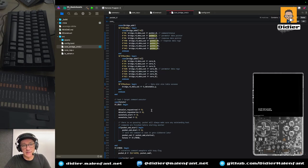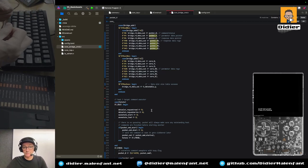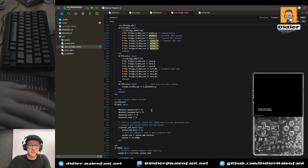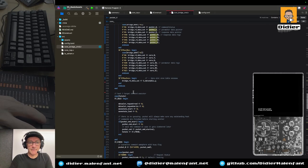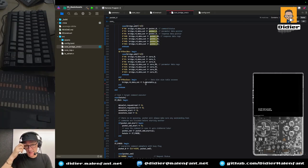And I'm thinking that the way this happens is this, as you see on the packet when you boot, basically during boot, the whole file gets written out to wherever memory the core wants it to be. And to do that, the packet is going to basically send a command, here's a file, and then start going through addresses that you told that you wanted that file to be, and it's up to you to get those addresses, get the data, and put them somewhere else. That's my assumption. I just want to make sure I understand this before I start implementing, well, copying this stuff and then kind of tweaking it to make more sense for me.